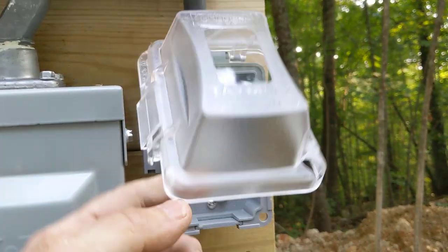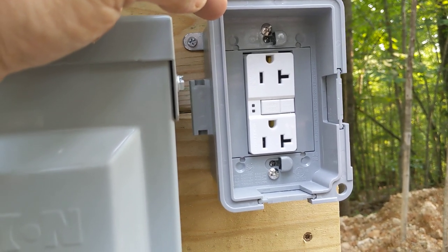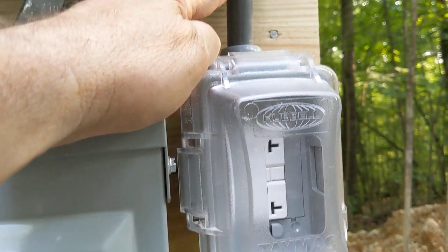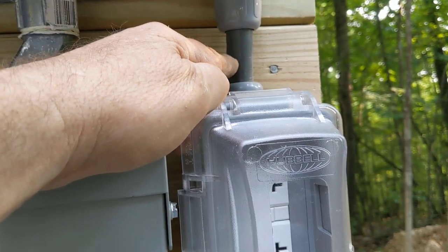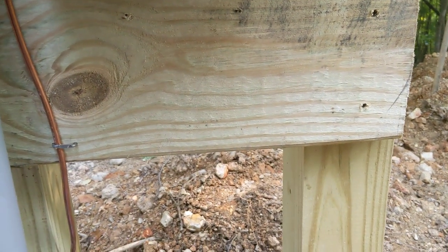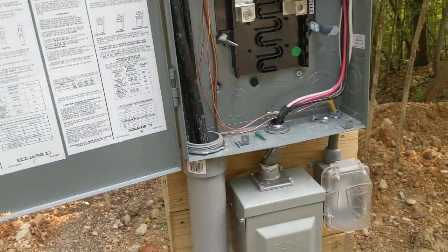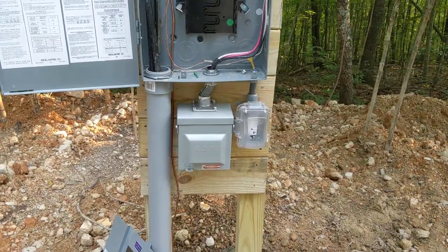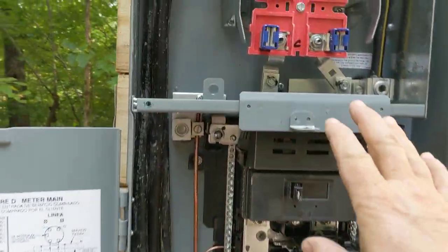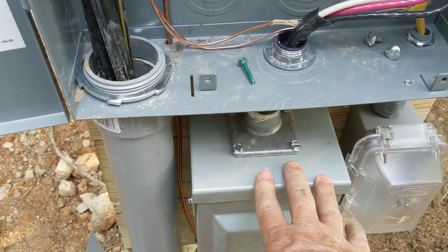All right, so we've got the 20-amp. I did have a 15-amp in there — bought it all together, thought it was a 20-amp, but my son-in-law pointed it out. So, we've got the weather-tight box with that flexible conduit. Now, just make sure when you go to put these up you can use 4x4s — don't use one, use two. Two 6x6s is awesome but it's overkill. If you're going to do two posts, do 4x4 if you can. This is a Square D — go with the Square D. Eaton. That's how they say it in Tennessee and Georgia.